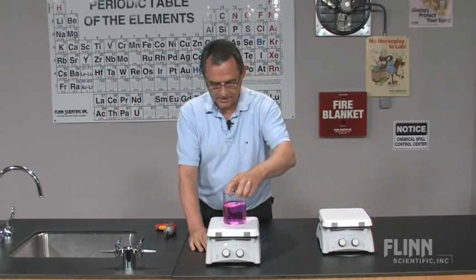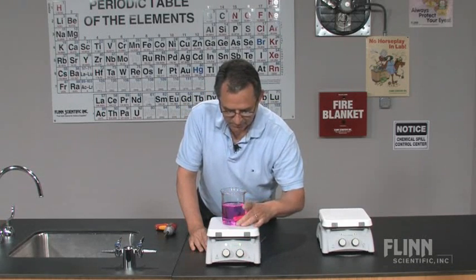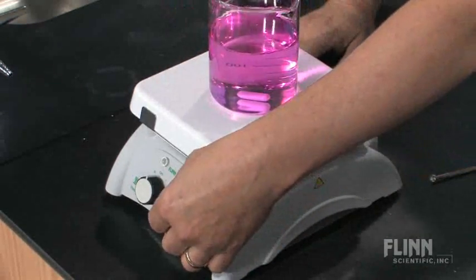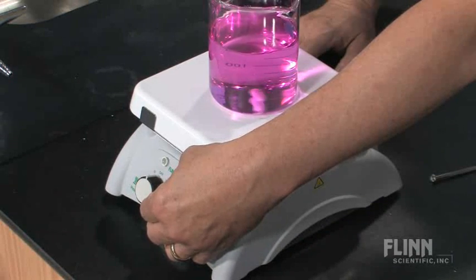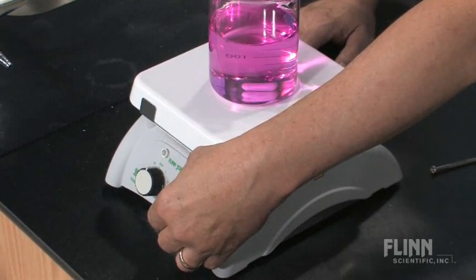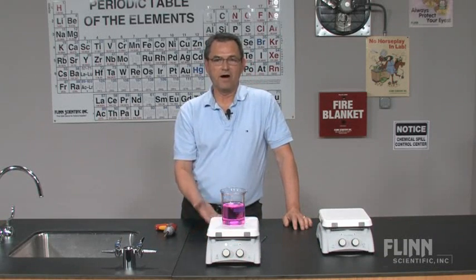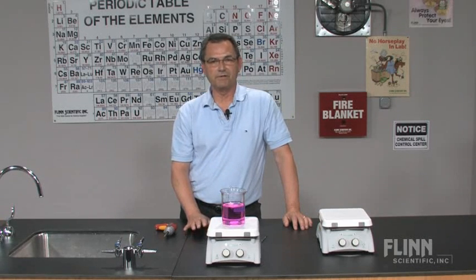Put your beaker back on, turn it on to 1. What you're seeing there now is I turned it back too far — the hot plate stirrer is barely turning, and it doesn't really turn until you get to a setting of about 4 or 5. If this occurs, simply reiterate what you've done: take the bottom off, turning it now clockwise slightly, until you get the proper spin rate.